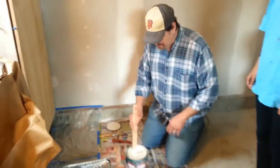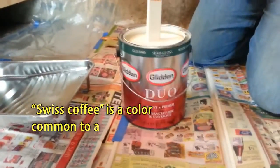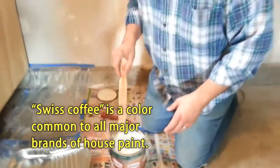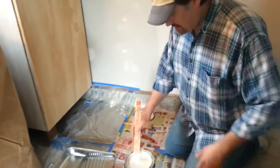Unless you're going to paint within about 30 minutes of actually getting the paint home from the store, you're going to have to mix it again. It's been mixed already. This, although it looks white, is actually what they call Swiss Coffee — that's their color for it — and there are pigmentations, stuff in here that has made it a slightly off-white. The problem is that even after a day of getting it home, it will settle, and so you have to mix it up again. So that's what I'm doing right here, and I'm just showing my kids how to do this.